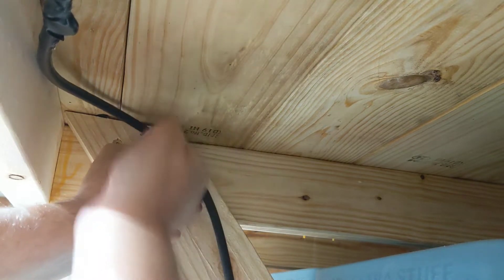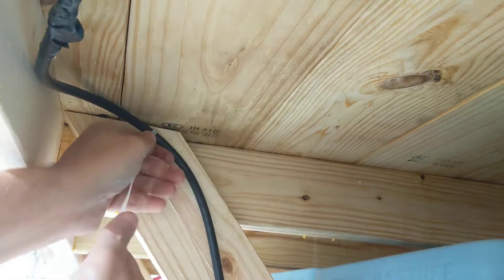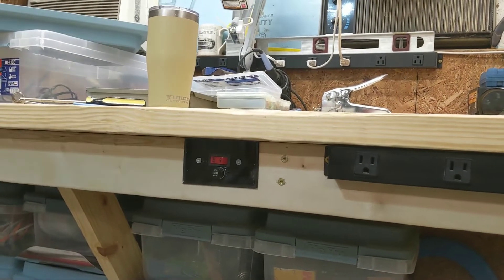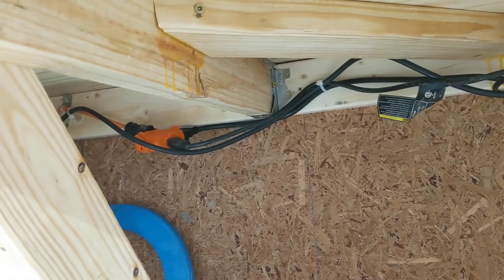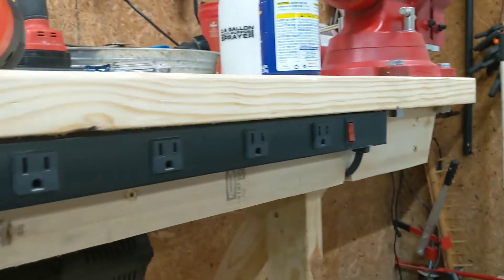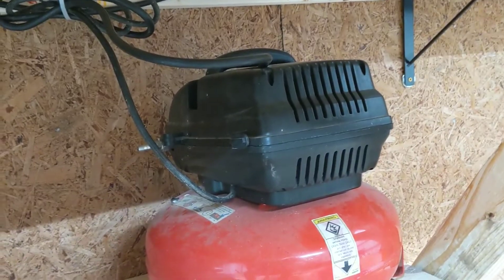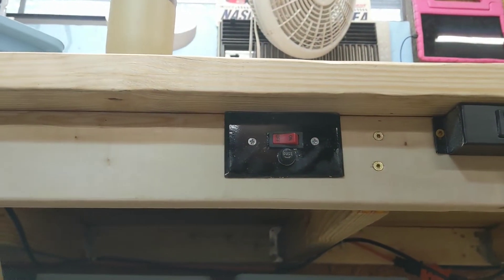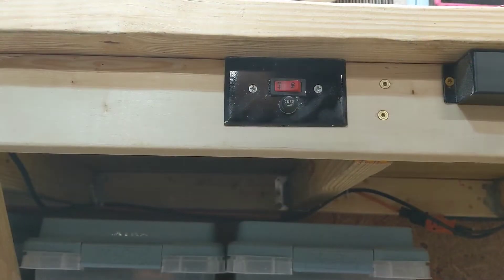Here I am doing all this wiring that I'm going to have to undo once I find out there's a leak. But this is the way I rewired it — using a U-shaped nail with a zip tie to route it. You can see the switch, the line goes back and then this way. It's plugged into the extension cord I ran, which feeds the air compressor and the power strip, all on a dedicated 20-amp circuit. Everything is zip-tied up and tucked under. Time to push the button and see if the compressor comes on.